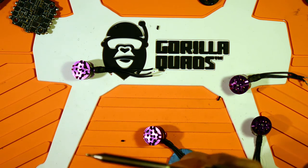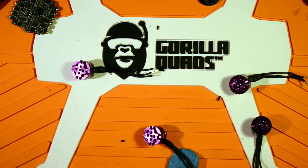This thing will time out and cool itself off, but I don't want to do that. So the longer you have heat on there, the faster the tip corrodes. And then you start buying new tips, because once your tip oxidizes, or gets oxidation on it, it stops transferring heat as well.